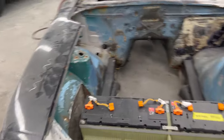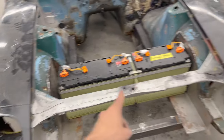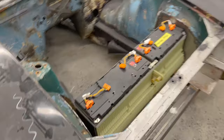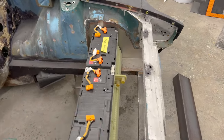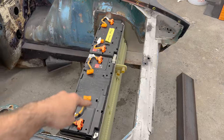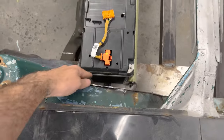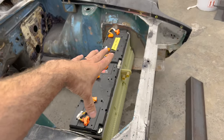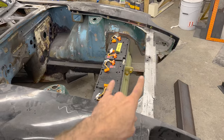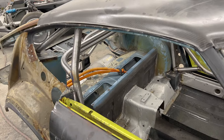You would have seen in the very first episode that I cut a notch in this section of the inner fender well — that's obviously to hold the batteries. As you can see, I set one in here. They have a little bracket on the bottom that they mount to. These two longer batteries are kind of weird because they have a side inlet and outlet for the coolant, which is nice because I don't have to have even more room to route coolant lines out here. So these work perfectly up front, and these two together should weigh exactly the same amount as the rear Tesla drive unit — just this one.